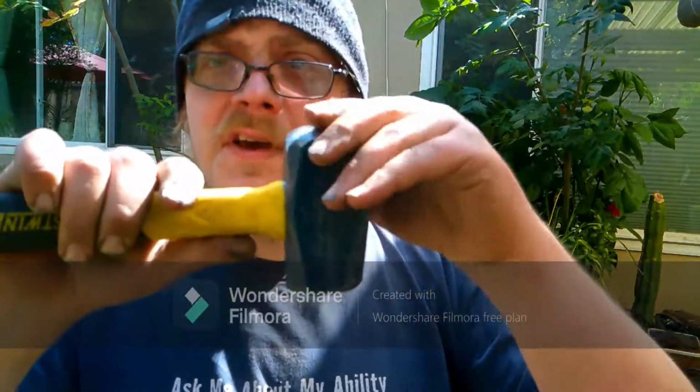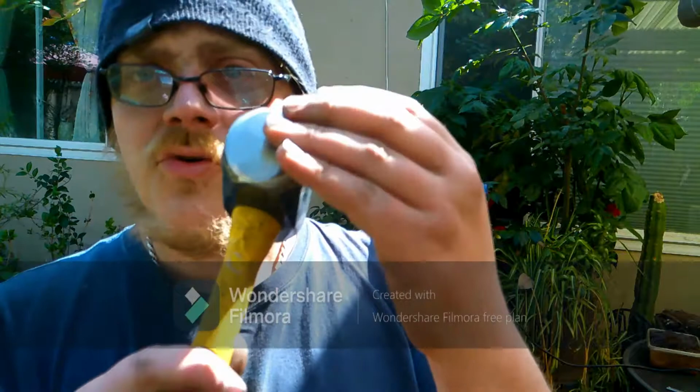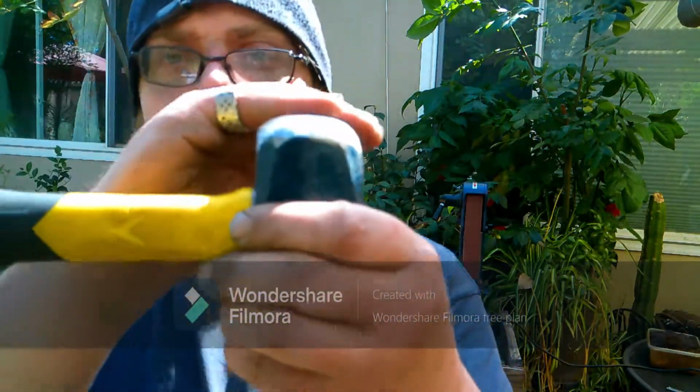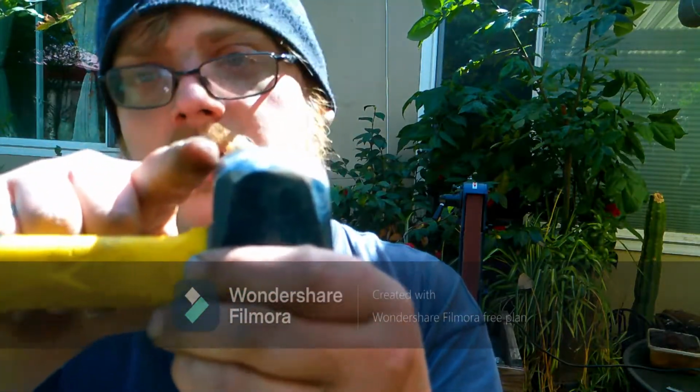Alright, so this was the face that I already did. This was the face that got messed up. So I just got done refacing it, and I realized, why not do a little video where I explain how you go about this. The key piece of information to keep in mind is that a forging hammer, a hammer used for moving metal in blacksmithing and bladesmithing, has a rounded face. Not only that, it has multiple radii of roundness across the face. On the very top of the hammer, it's got a very shallow radius, and as you go towards the edges, the radii get smaller and smaller.